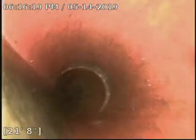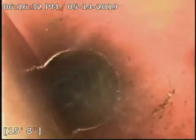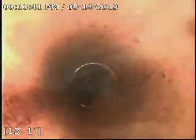It gets a little low in through here, probably about two inches at the worst of it. Shouldn't cause any problems though — you can see it never goes fully submerged, so there's going to be some water sitting in there. A low spot on its own won't cause backup; it's got to be other factors. So it's a little low going out from the house, but a perfectly working, perfectly workable sewer.